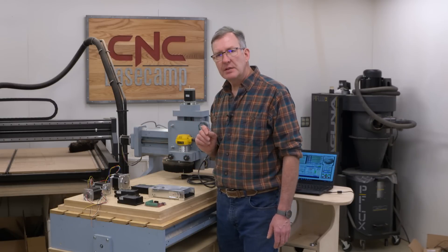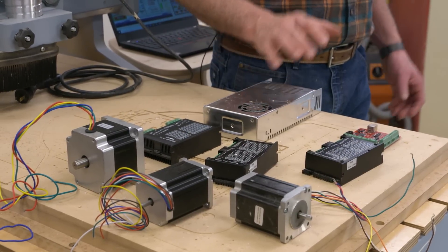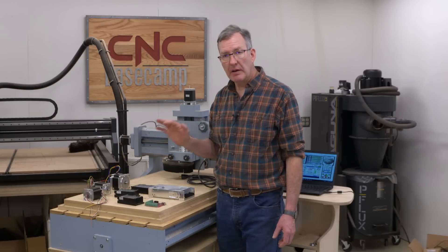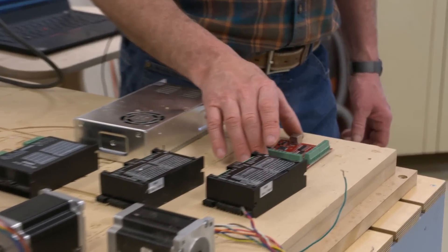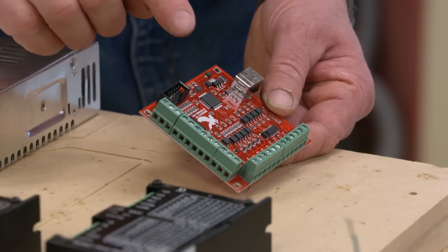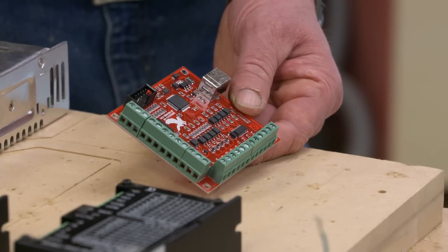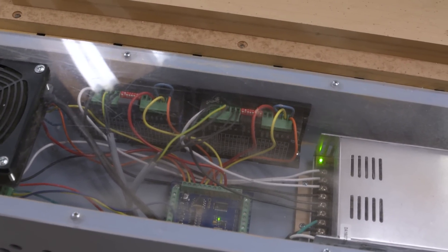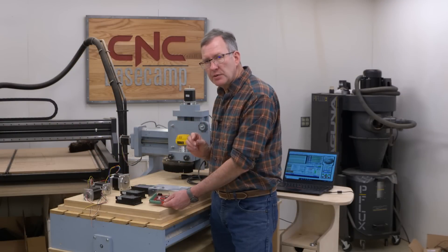One important thing is that you choose a cable that's shielded. Electromagnetic interference can always be a problem with a CNC machine — it can happen from dust collectors, any kind of motor, or electronic devices functioning around them. So shielding is important. In order to control the motors, we need what's sometimes called a breakout board or controller. The controller has microelectronics in it which tie everything together and help interpret the G-code being sent to it. All the connecting points will connect to those cables, which connect to our drivers, which connect to the motors.